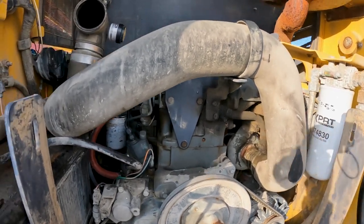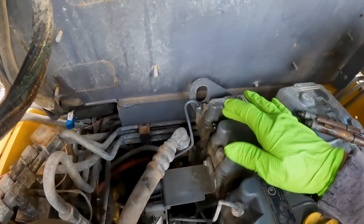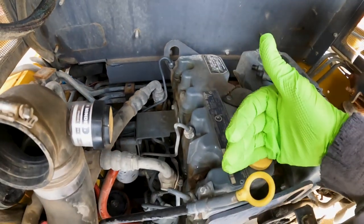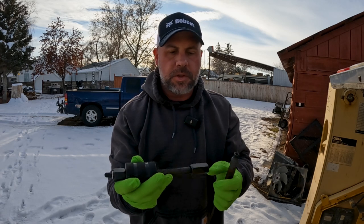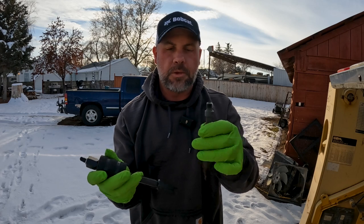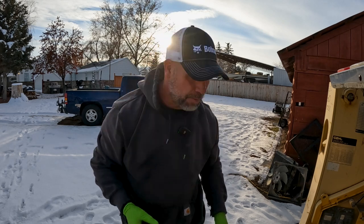Now I'm in the process of pulling the injectors out - I've got two injectors out already and these were a real bear to get out. The Deutz engine starts cylinder counts from the flywheel side, so this is one, two, and three - same way on the four-cylinder. These are straight pin type injectors and they just get rusted and corroded and stuck down in that bore. I've got different slide hammers for injectors - this one's really cool because it's got a collar that fits both M12 and M14 threaded injectors. This is an M12, so we just screw that slide hammer right on top of the injector and slide hammer it out of the bore.